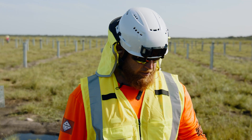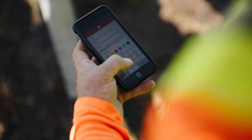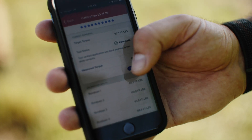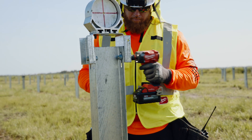We're in the field — we're going to click on the One Key app and set the torque value to 97. We go into the app, we test the tool first 10 times with a digital calibrated tool, put that data in, and then it can meet the torque value. We don't have to worry about over-torquing because it has that auto-stop function.